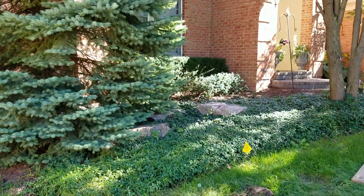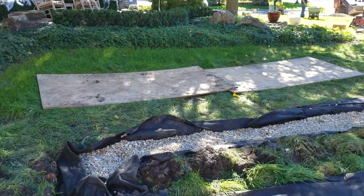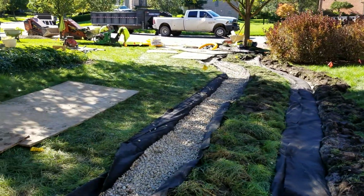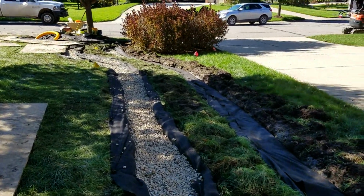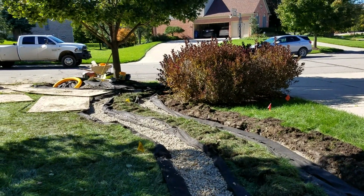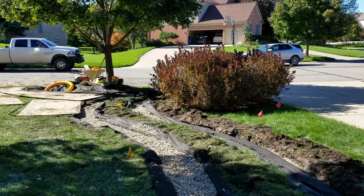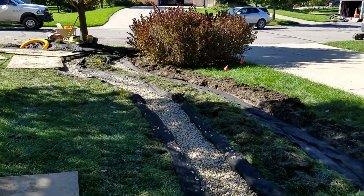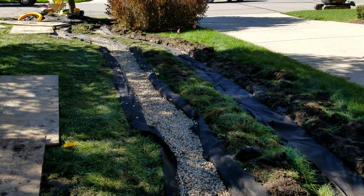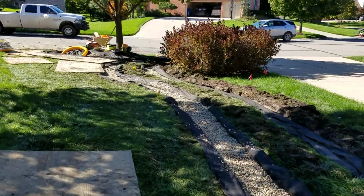This homeowner that contracted me, they have their own roof water, and the property's elevated, and then it comes down to the side lot here where it's a low point. You have the parallel stone Freedom Drain or French drain systems. And normally this water would just run down the swale out over the curb. There's been a bunch of landscape put around an electric box to hide the utilities. That dammed that swale. This already wasn't a good situation with just the high volume of water that this area was collecting, and it may have needed a French drain even without that landscape, but that landscape most certainly made it worse.